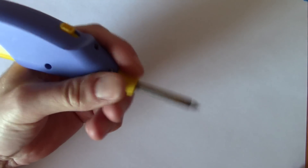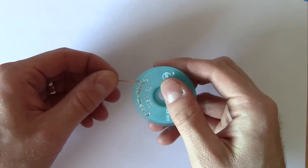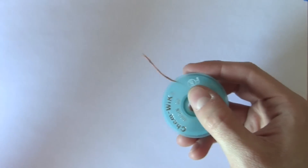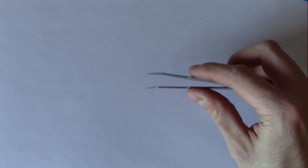I can get right up close to the actual work, which gives me much better precision. The other thing that we're going to need is some solder, in case the solder pads happen to get run dry during the process of removing components. This is some very, very tiny little solder braid — it's rosin impregnated, so that lets it suck the solder up into the braid. When you get some solder saturated in here, you simply pull out a little bit more, cut off the dead piece, throw it out, and keep going. The last thing I'll find very useful is a pair of very fine tweezers, because I need to hold both the old fuse and the new one when replacing it.